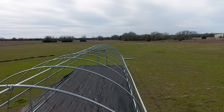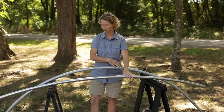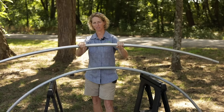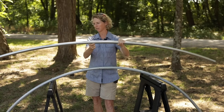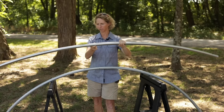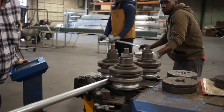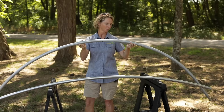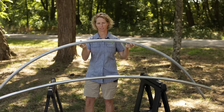This is a good example of how different the radius or arc is on a 10 foot versus a 20 foot bender. This is an example of our US-made steel and our 20 foot all-metal kit — you can see how smooth and even the arch is; this is a machined piece of metal. This is an example of a galvanized top rail that's been hand bent. If you're doing things by hand, you're going to have a little bit of imperfection — and that's okay.